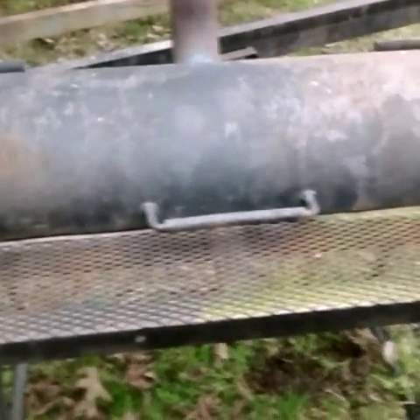That's that pit. The doors will be cut off and squared like I did on the pit I gave to the church. You can see the burn box is backwards, so I'm going to take it all off of there. I'm going to weld that door back shut, do the door on this side, connect them, and turn this whole thing into a reverse flow smoker.